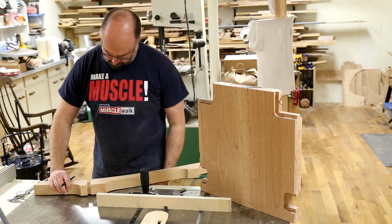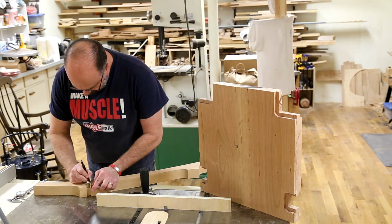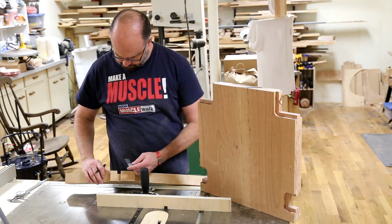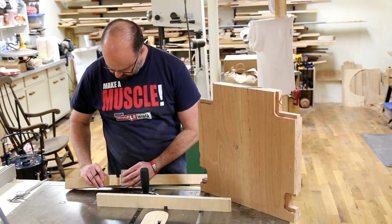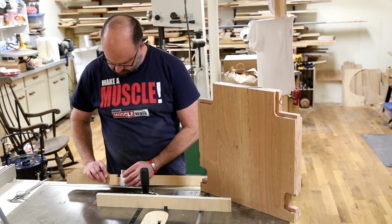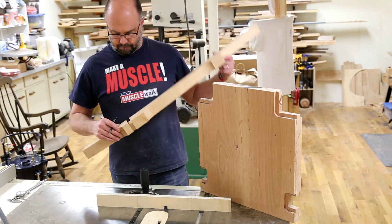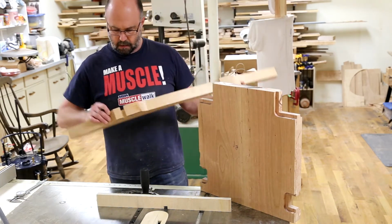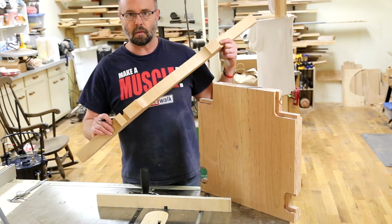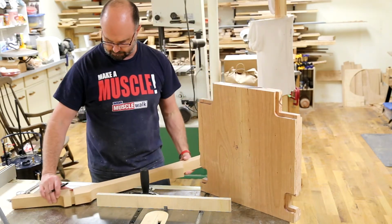Based on how I made that mark, I know I want to leave the pencil on there. So I have this little engineering square. Hopefully I didn't step out of frame, but the little engineering square there. We'll come around on this side. So I now have two references to set up for those next two cuts on the saw. Based on how I'm going to set them up on the saw, let's just sort of do this one. We'll do one sort of on the camera till we get to fit, and then I'll just go and do all the rest off camera.